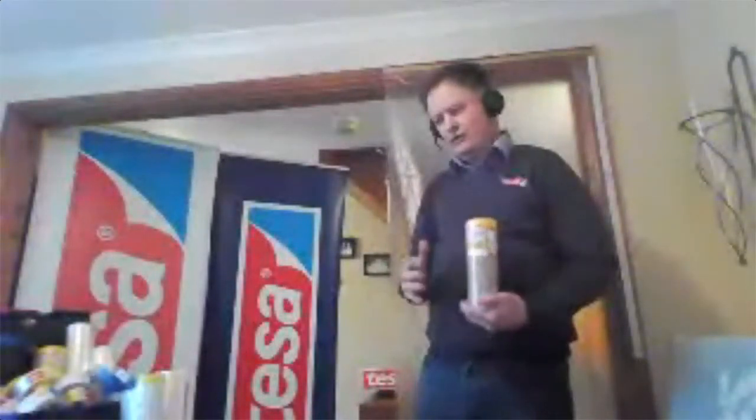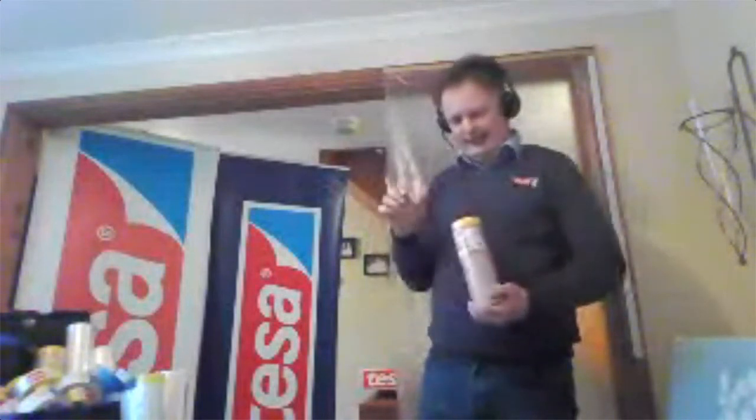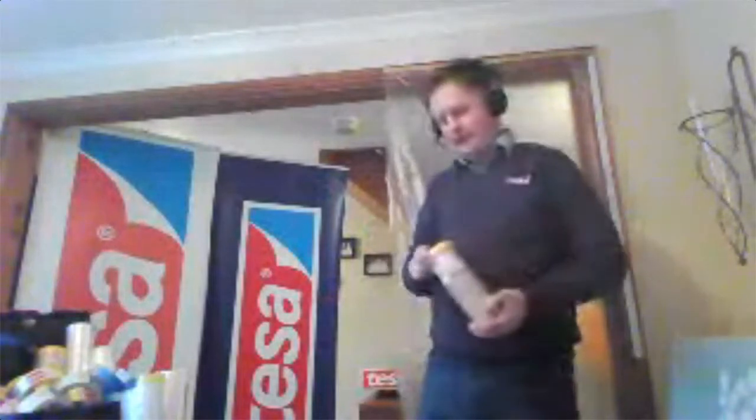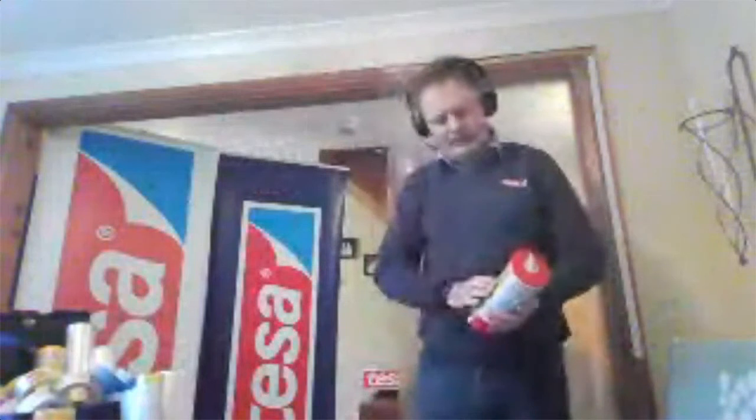The Easy Cover paper is very good because you can use it on skirting boards. I saw Nick using it on handrails, and effectively it covers an area, and it tapes one side, and it can catch overspray if you're doing it on skirting boards, or around edges, if you're doing walls and that kind of thing. And it's a very good product because the paper is a very good grade anyway. The precision on it, it is a precision tape. It is a slightly different color, but it still has a 3-month inside ability to leave no residue when you've used it. And again, these things can all go into our standard dispenser.